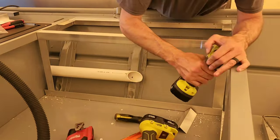I worked on the livewell surround decking. The goal for me is to use the least amount of deck parts as possible. The less deck parts, the less joints. The less joints, the stronger the deck. But also, because this boat would get custom turf, there would be turf breaks or gaps separating the individually routed EVA foam parts. Wherever there's a break in the turf parts, the aluminum decking will be exposed. So this means my sheet aluminum work would need to be as tight and precise as possible. This accurate aluminum work takes great time and care, but in the finished product is a detail most people commonly overlook. I always say it's all the things that you don't see that make what you do see in the finished product look as good as it does.